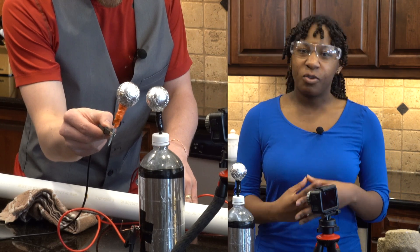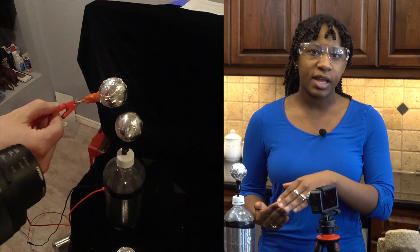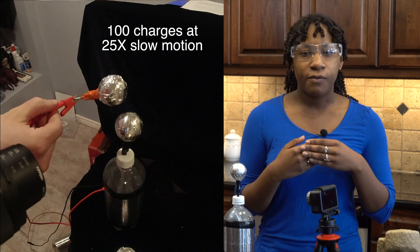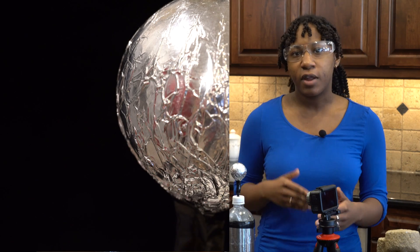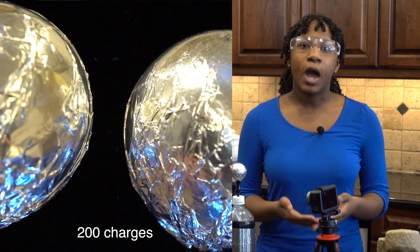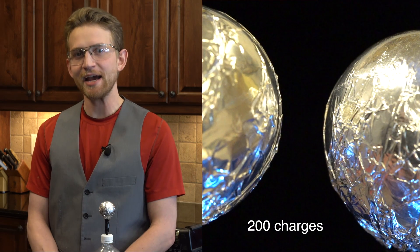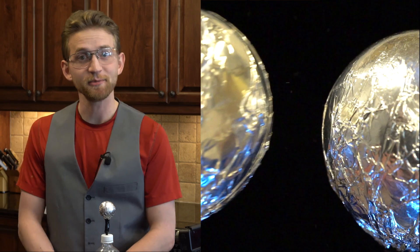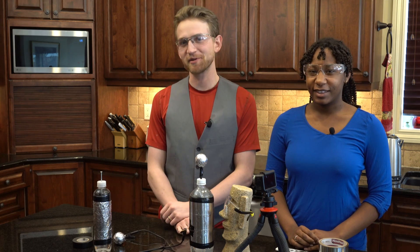A capacitor is any two electric conductors placed close to each other with some sort of electrical isolator in between them. In our case, the conductors are salt water and the foil, and the isolator is the plastic bottle. The capacitor stores energy in the form of electric fields. If there is a way to place a charge on one side, the other side will attract the opposite charge if given a path. That's why it gives a shock when we touch the foil without grounding it. As soon as you get close to connecting the two sides of the capacitor, the two electric fields create an ionized conductive channel through the air, creating light and sound. Super cool stuff. Thanks for watching, and remember, stay safe. We have new videos coming out every week, and stay tuned because bloopers are coming up.